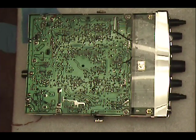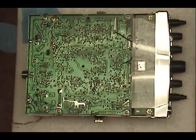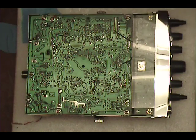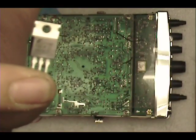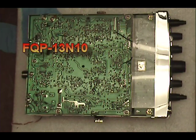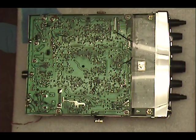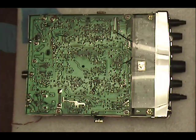What we're going to do today is a MOSFET final replacement in a Cobra 29LX Chrome. I'm going to put this MOSFET final in it. It says FQP — Frank Quebec Papa — 13 November 10. FQP 13 N 10. I just started using these. They're like the IRF 520s — they replace them directly. I seem to be getting a few extra peak watts out of them, and every little bit counts. These guys are alright, might start using them for a while.